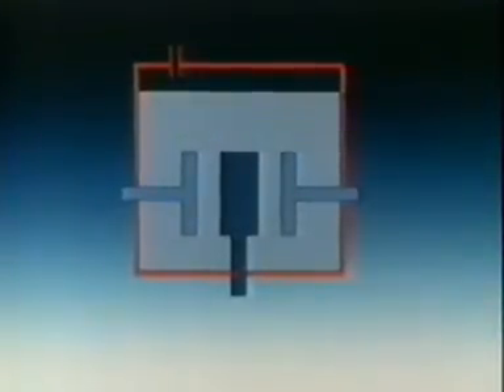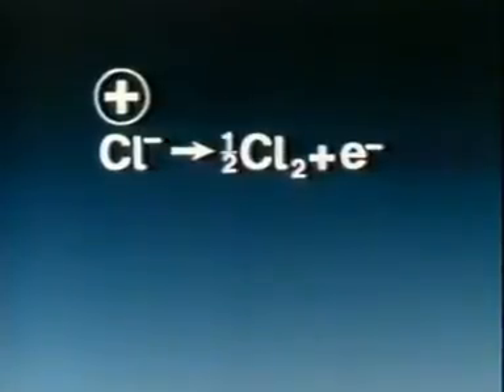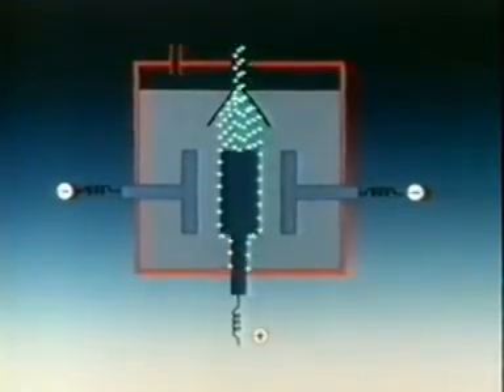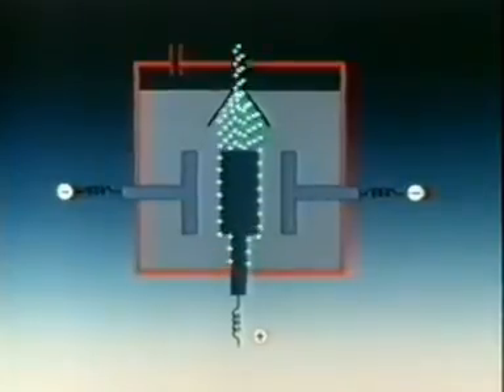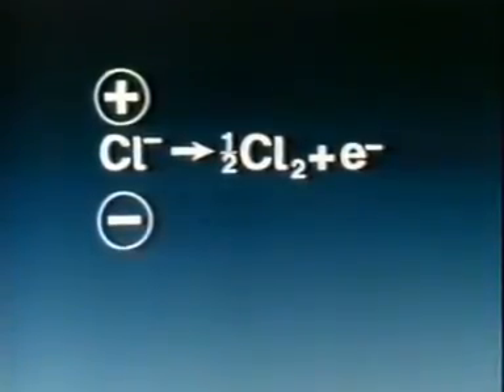This is a cross-section of how they work. When the electrodes are connected to the power supply, chlorine gas is liberated around the anodes. Because the anode is positively charged, it attracts the negative chloride ions. Each chloride ion gives up an electron to the anode and chlorine gas is produced. The gas bubbles upwards and is collected in a trap called the bell, made of nickel, and piped off and used. At the cathode, metallic sodium is liberated. The negative cathode attracts positive sodium ions, and each ion picks up an electron, giving sodium metal.